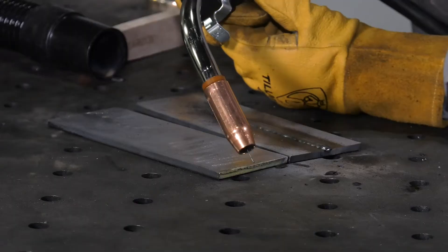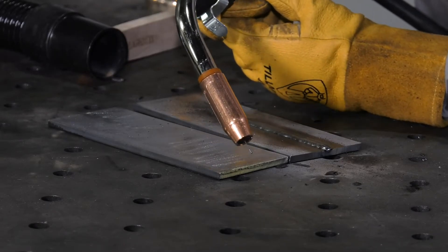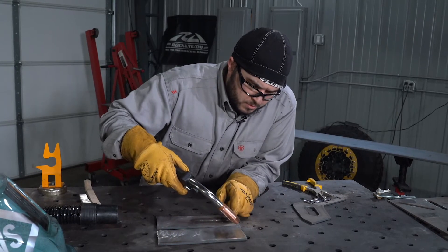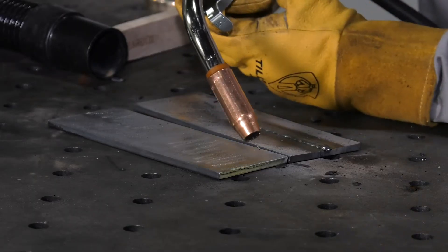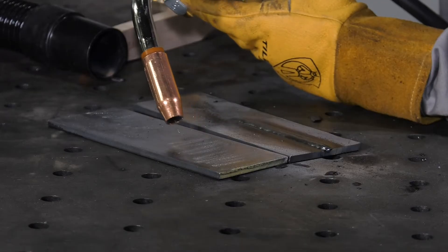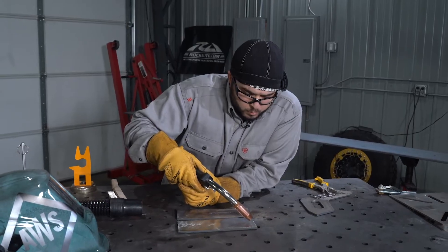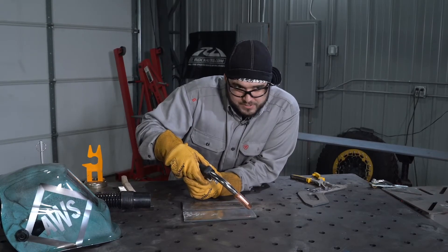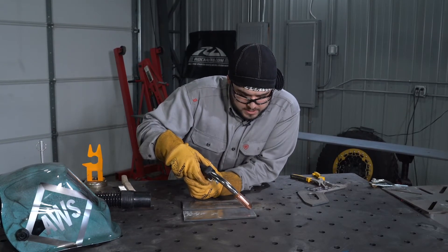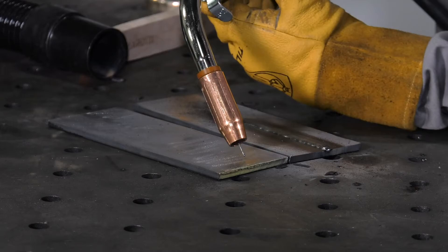When welding with the flux core arc welding process, we're going to start by striking our arc at the end of the plate. We're going to use a drag motion since it creates a slag. We want to make sure that the wire is about three-quarters of an inch away from the contact tip — that's our contact tip to work distance. We're going to maintain that three-quarters of an inch while welding across the plate. When you're ready, squeeze the trigger to start the arc. Once the arc is struck and the molten pool begins to build, we want it to reach about a five-sixteenths to quarter inch weld size. Once you get that, begin moving forward maintaining a constant travel angle of about 30 degrees.